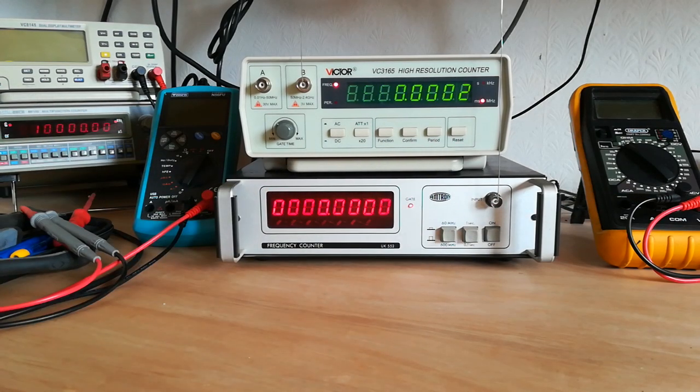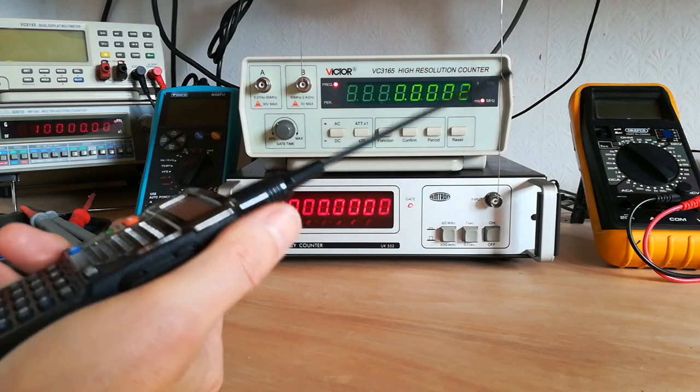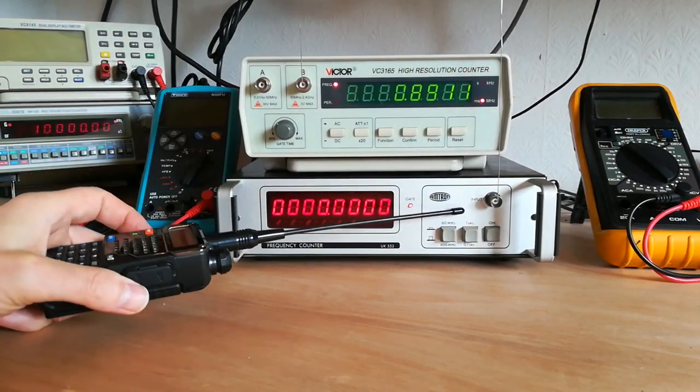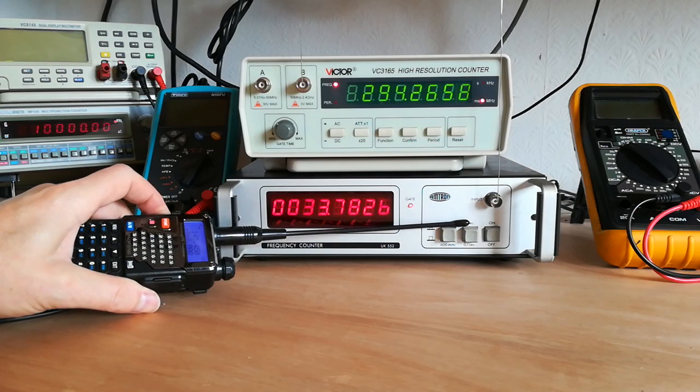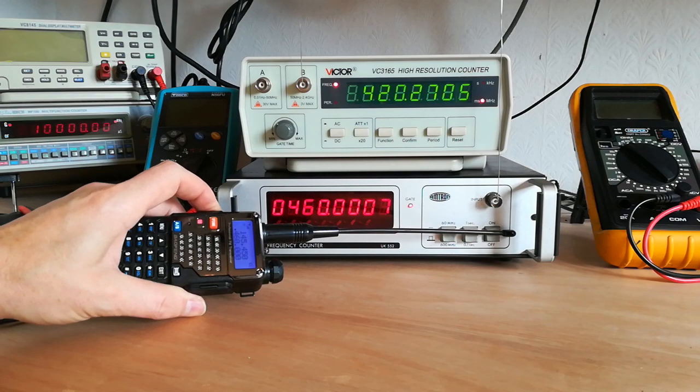So although the top one works fairly well, it's quite slow. But it's okay if you're just probing a crystal oscillator or something and you just want to know where you are. Also a difference in the construction — this is plastic, this is aluminium. The shielding is much better on this one. We can put the antenna right next to it and key, and it still works. We don't have an issue.